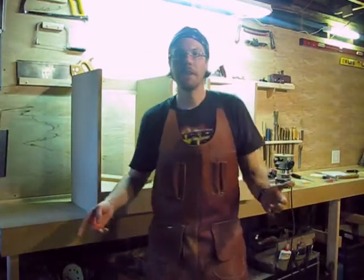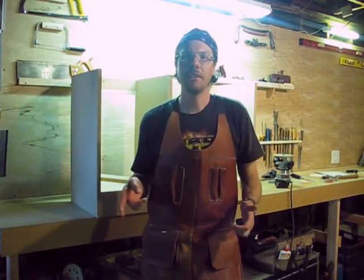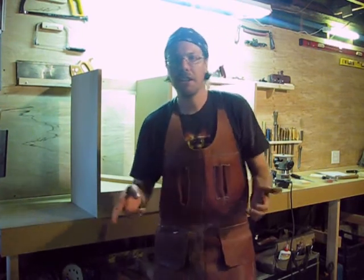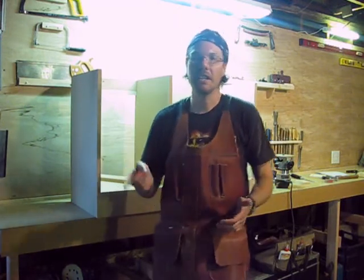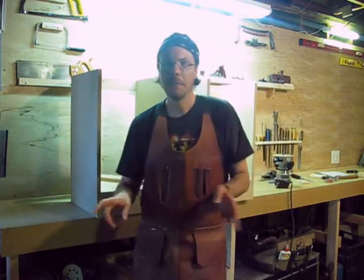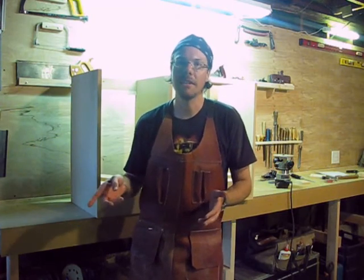Okay, so now we're in the phase which most cabinet shops call detail. Usually the guy standing there doing detail is like a senior apprentice. Probably he's already done a turn as a sander and an assembler and maybe building face frames. And then they think he's steady enough he can start doing detail. But that's where you put on all the little roundovers and things, which you can't really do ahead of time. You got to wait till the cabinet's assembled.